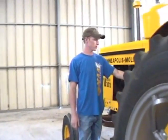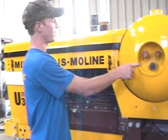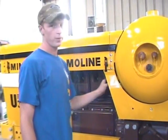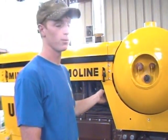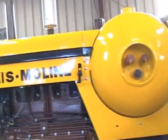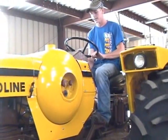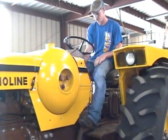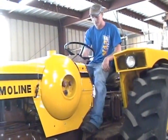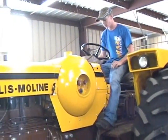First, I'll come over here and show you how to start the tractor. It's a little bit different than a gas or diesel tractor. First, you have to turn a vapor valve on on the propane tank. The propane goes through a vaporizer and then to the carburetor and then to the intake. There's also a safety procedure — it has a safe gear. You have to put it in S, safe gear, before the tractor will start. It's just a safety feature Minneapolis Moline had on their tractors. Make sure the carburetor is on.